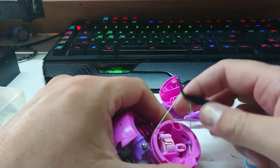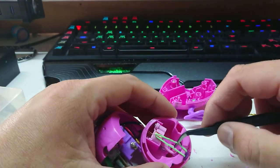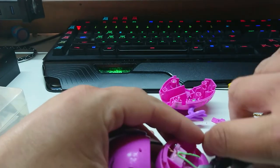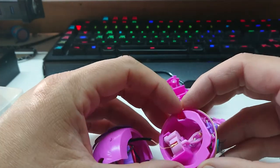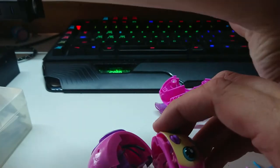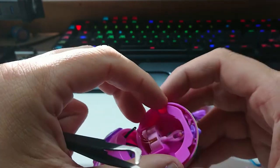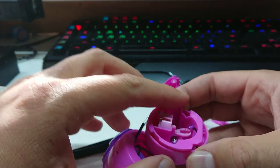This allows us to have a look at how the mechanism actually functions, which is the bit I'm curious about. I'll be careful - these wires are very thin enamel wire. So we actually have what looks like a little voice coil actuator in here that is causing movement backwards and forwards. In here there seems to be a magnet on a lever, and they are switching the polarity in the voice coil to determine how it moves. The beak will open and close according to its position, which is driven by a slot in here acting like a cam - as it moves up and down it opens and closes the beak.